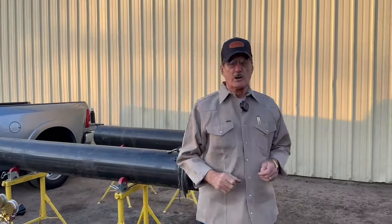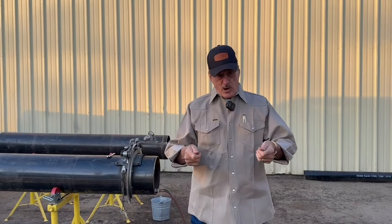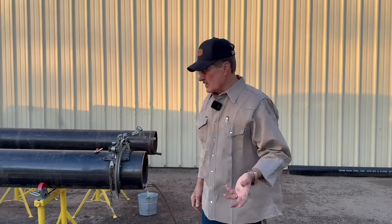There's nothing written in stone, but you can look up any of the Victor torches and they'll tell you what size tip to use for what you're cutting. If you use a tip that's too big, you can throttle the oxygen settling back, get the flame a little lower, and use it on thinner stuff. A lot of times that's what welders do — we're a little lazy. Most welders use a number one for everything, and sometimes it's good and sometimes it's full of slag.